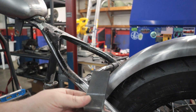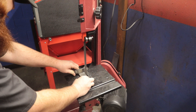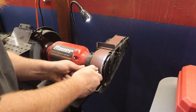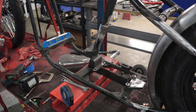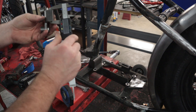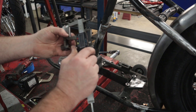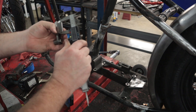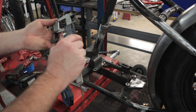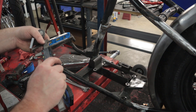All right, we're gonna head over to the bandsaw and get this cut. Now, to find the center here — I like to work in millimeters. I spent a long time working for the Japanese, it's just how I'm used to doing things. So we've got just a hair over 35 millimeters. To find center we're talking 17 and a half — a little bit over 17 and a half, like not quite 17 and three quarters — will give us center.